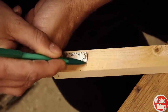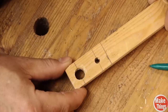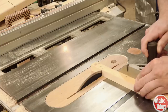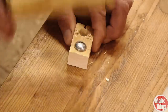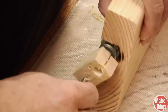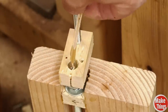Now we'll add a crank, which is nothing more than a two-inch piece of the 1x4 we cut earlier. We'll measure in on both sides about a half inch. One mark will get a quarter-inch hole drilled out while the other will get a half-inch hole from a Forstner bit. We'll add a prong t-nut by tapping it in and drilling out the divots with an eighth-inch drill bit. We'll cut the crank off, make some epoxy, and add it to the three-inch bolt end, tapping it in place. We'll glue the t-nut in just enough so that it lays flat to the board before allowing it to semi-cure. After about 30 minutes, we'll add a few washers to the end where the threaded rod is jutting out and the crank. We'll stand the jig on its side and drop epoxy into the t-nut hole, this time allowing the entire thing to fully cure.